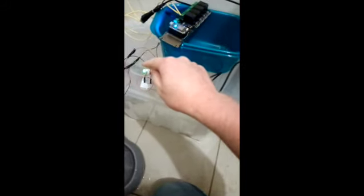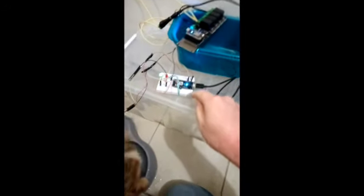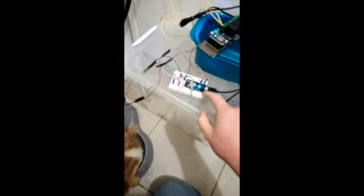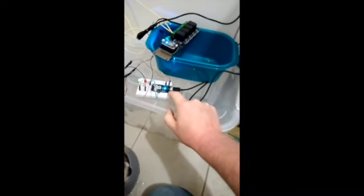We've also got a green light here, to tell us that it's full or above 10% full, which will come on providing it's above that 10% threshold. If it's below that, it'll turn red, and that will automatically turn on the blue LED next to the USB jack on the Particle Argon.